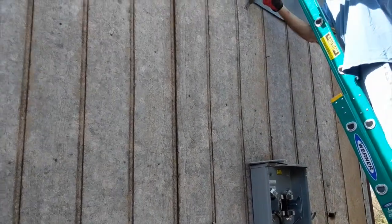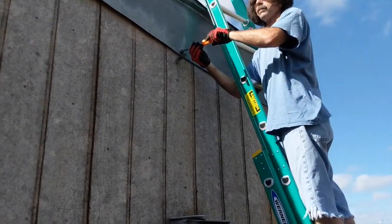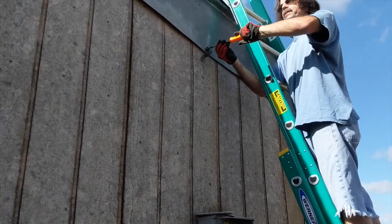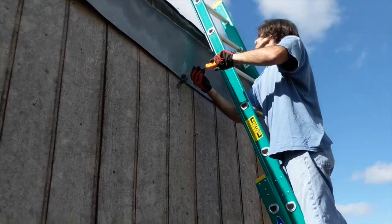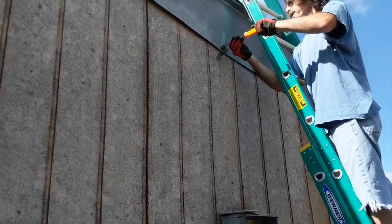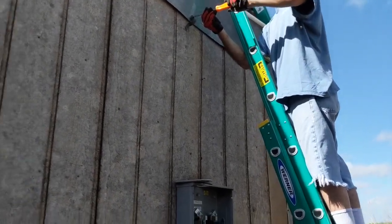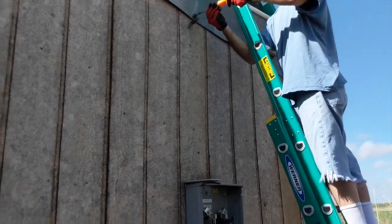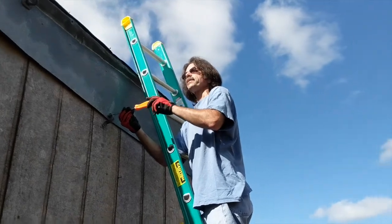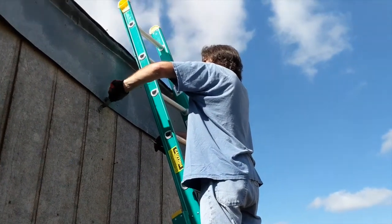Why, they did not have 200 amps in the 90s? Oh, yeah, of course they did. Someone was just being cheap. If you have an 80 amp meter, you just need to feed it with an 80 amp wire. Yeah. They're just being cheap. No, we really didn't think that all the way through. That was pretty thick wire to me, coming down there. Until you tried to put 3/0 wire through a 1.5 inch conduit at a 90 degree bend that's not even a foot long. Oh, that sucked.